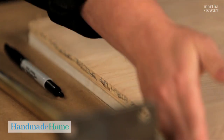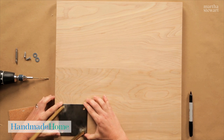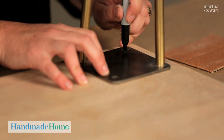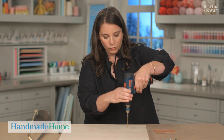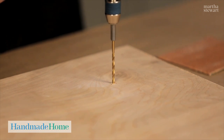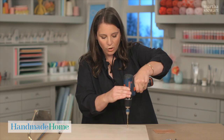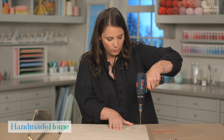Once the edges are smooth, apply the table legs about a half inch from the edge of the plywood. We're going to pre-drill a hole, so you'll need to mark where the screws are going to go in. With the drill bit, drill directly down and only go slightly in because you don't want to go into the tile. Just lightly drill each of the holes.